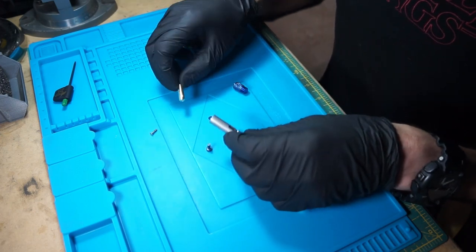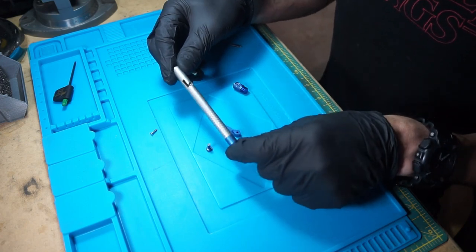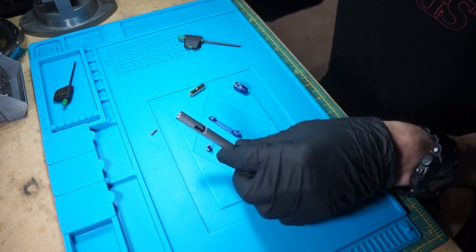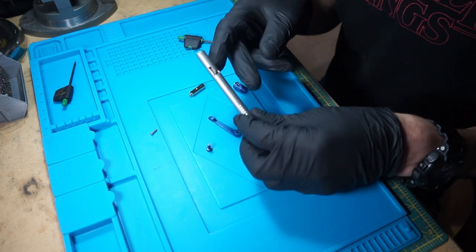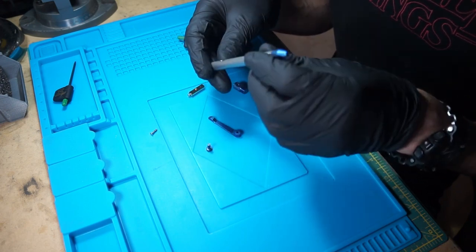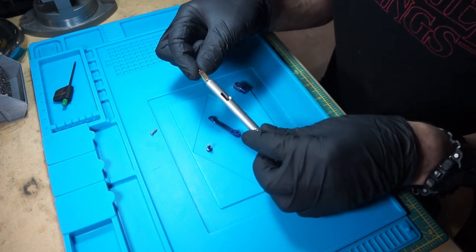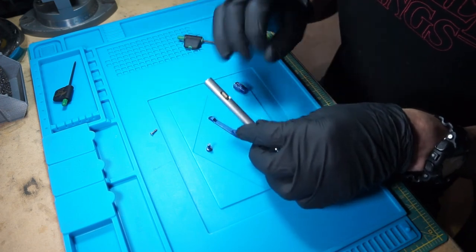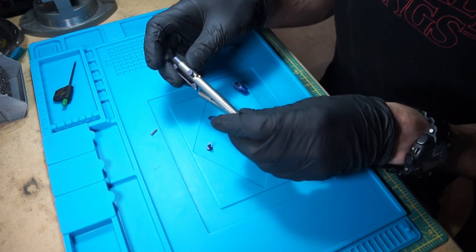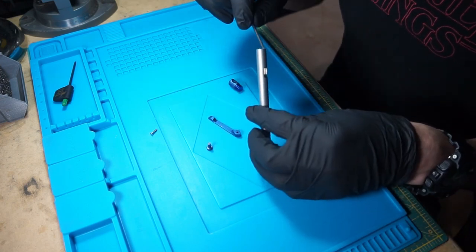Drop the whole pen in. Another thing I did with all the bodies now: the old bodies I used a tube which didn't have an exact internal diameter, which was okay, but I just couldn't get the wall thickness I wanted. The whole production batch of tube I ordered was the wrong wall thickness, which made me think quickly on my feet. So I purchased solid stock, drilled it out, and reamed it. It's exactly 0.25 inches on the inside, which means the refill fits perfectly. There's a little bit of clearance to allow for changes, but it lets me size the bolt pins so they slip in with just a little bit of wiggle room and keeps everything nice and tight. It turns out it's way nicer — way more work, but much nicer result.